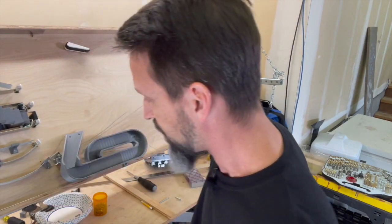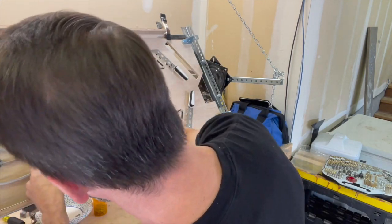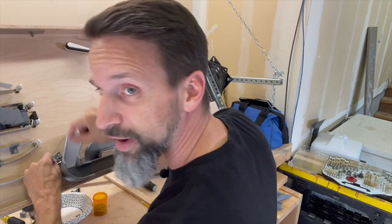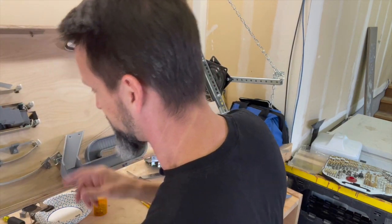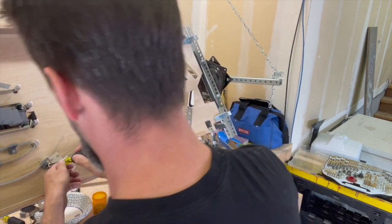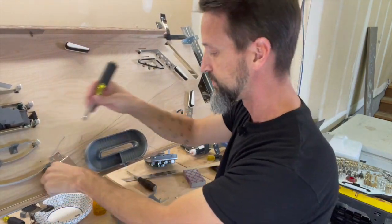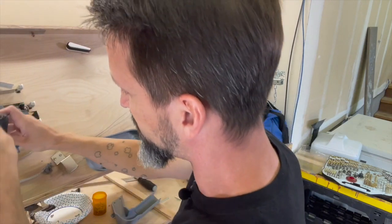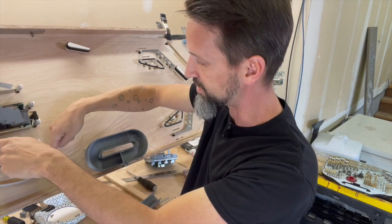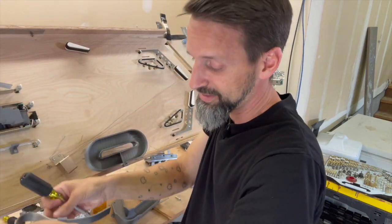All right. A couple of different ways. I went through and just took a screw, a few of these in 2 different sizes, screwed it in, and then kind of drew around that with pencil again on the playfield to tell me, okay, this is where the center of that needs to be. So I did that, and then pre-drilled a hole. We're going to take this piece out also because this metal is a little bit too short. We're going to need to recreate this piece. It needs to come out a little further along here to come up along the side of the ramp. Again, didn't know exactly how long we needed until we had the ramp done.